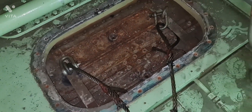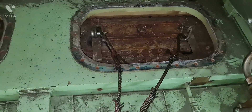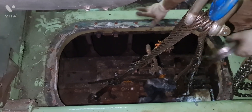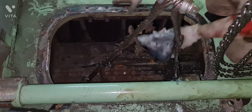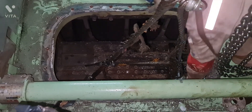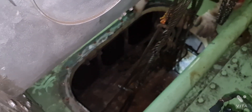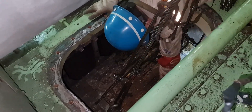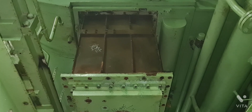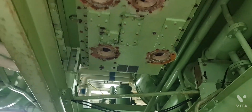On top of the air cooler, install some shackles with wire sling and connect to the chain block. If the main engine air cooler assembly is not possible to loosen down by slacking the chain block, use a hydraulic pump to push down the air cooler assembly until it is completely removed from the air cooler casing. As you can see guys, the main engine air cooler assembly is slowly going down until completely removed from the air cooler casing.